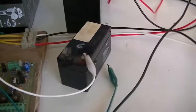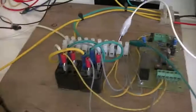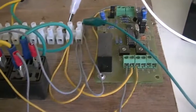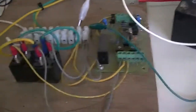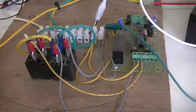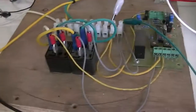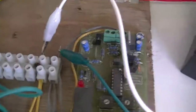The little battery here is running the timer kit, and that is completely isolated from the system, because of the mechanical relay here and those two relays there. While it's not running, the two relays are open, and when it runs it will switch the relays on and off, opposite to each other. The duty cycle for each relay and the time is all adjustable on our board, by the two little pots there and by the jumper clips.